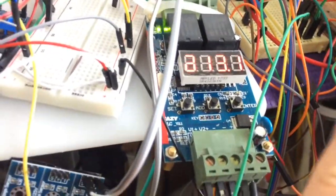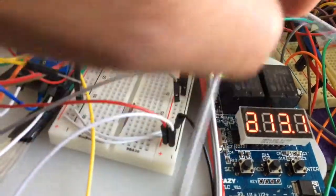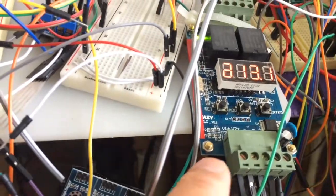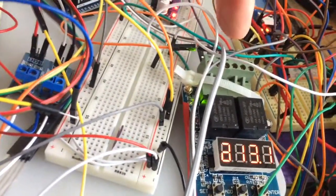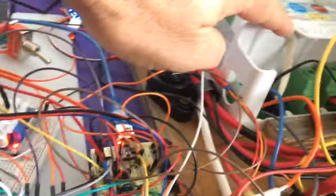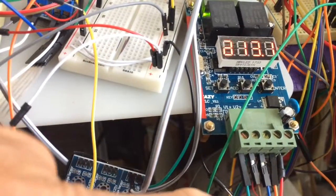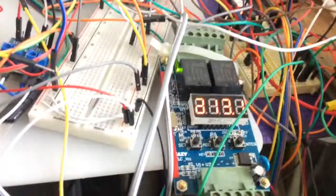You can also find these sorts of voltage sensing relays online, and you could, as I have done, use the relays here in actuating the BMS lines, which I've shown videos about. So this is a really nice little tool, and it isolates all your boat electronics on this side from the interaction with the BMS, so you're not likely to blow anything up if the BMS lines over here end up giving back negative voltage. You're unlikely to blow up your boat electronics here, which isn't much, right? You're just inputting your battery voltage here, and you're inputting power right here. So that's my short talk on relays.